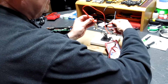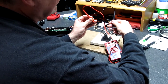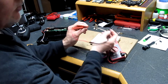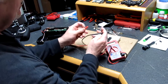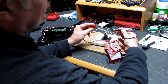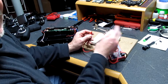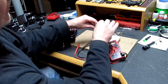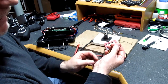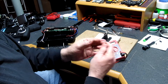Okay, as you can see, there's no continuity on this inner wire. Now let's check the outside of the pin. Now you can see there's continuity to the outside of this pin, but there's no continuity on the inner wire. So obviously you can't make a circuit. This is the original SMA cable — it's no good. I was not really getting a signal out of the transmitter. So that was my issue.